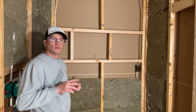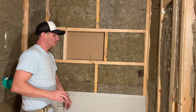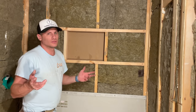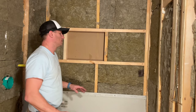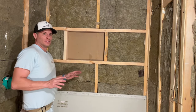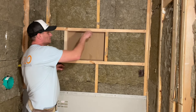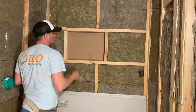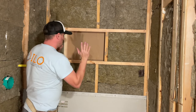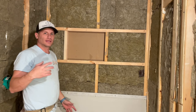The next day I started the cement board. This part is straightforward — I'm going to cement board the niche; you can use any type of membrane you want. What I do is cut a piece of cement board, silicone it to the back of the wall, then cut the sides and push that back piece in nice and tight so it doesn't go anywhere.